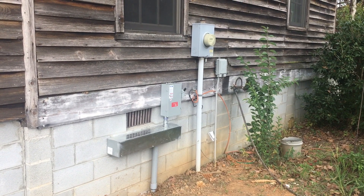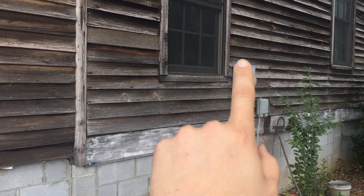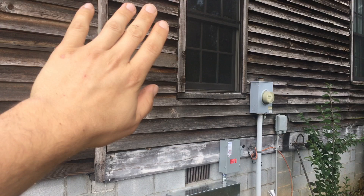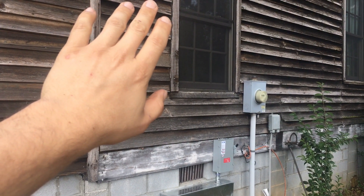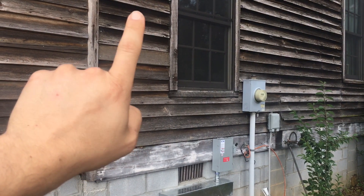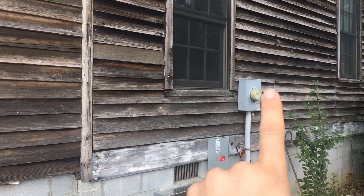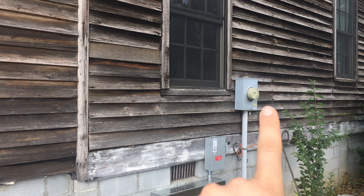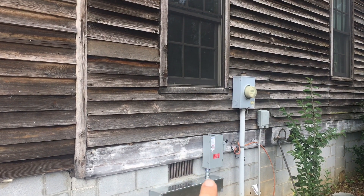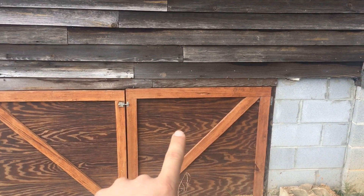Here is where we bring our solar array wires into the house — our disconnect and point of connection for the grid. There's a 200-amp panel on the backside of this meter base. We installed a critical load sub-panel on the other side of this window and moved all the circuits from the main panel to the critical load panel that we want backed up when the power is out. We fed a 50-amp circuit capable of back-feeding 30 amps to the panel through this disconnect for the utility.